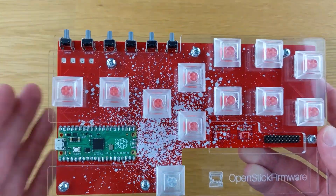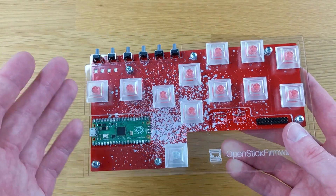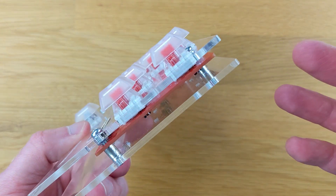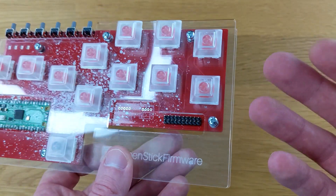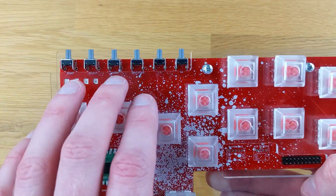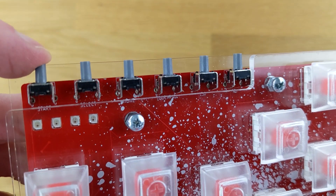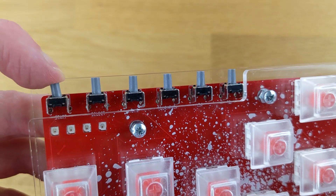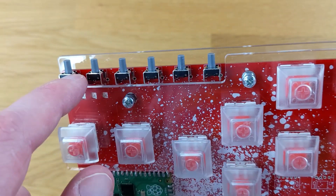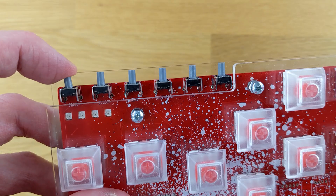In all fairness, just remember this is a prototype. The approach they're taking is kind of like a Raspberry Pi, where they provide you the base and maybe a few extras based on the package you want, but it's really up to you on what you want to do with it. For example, one of the things I'd be looking at is maybe redesigning a different case or adding some supports around the edges so it didn't really flex. The buttons on the top — I'm not the biggest fan. They have a nice selection, but they're not really confidence-inspiring. They wiggle around quite a bit and are not very stable, partially because of the micro switches chosen, but also because this case is entirely open. I wouldn't mind seeing a case with supports for these buttons in some way.